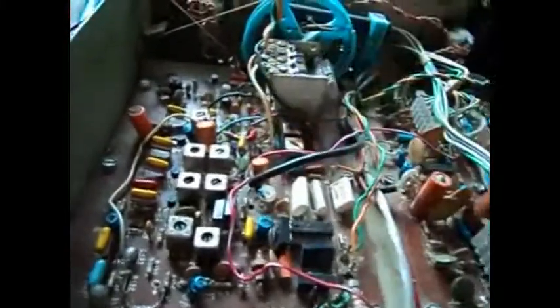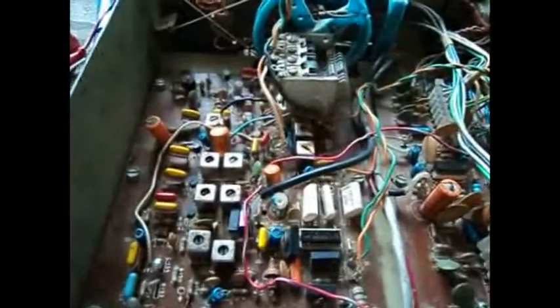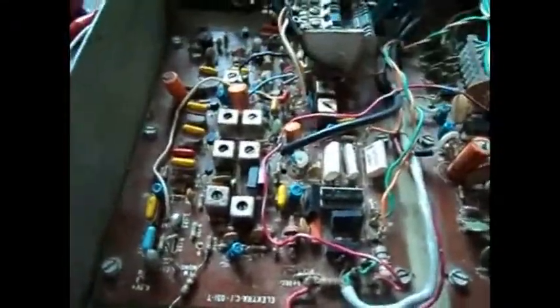So my two theories were either that the local oscillator wasn't working, or maybe this was bad, but I already did a bunch of experimenting with that, trying to replace it and tack a cap under the original one and all that stuff, but no change. So I went back and did some voltage measurements, and here's what I found. Luckily I had these voltage measurements from before when it was working fine.